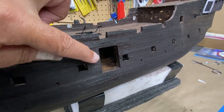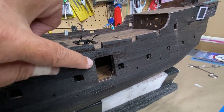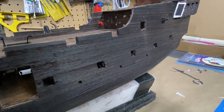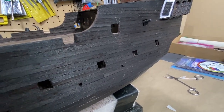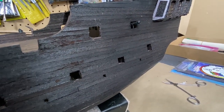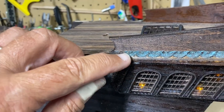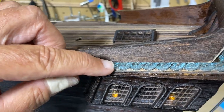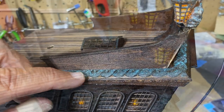There is an opening here that I'll work on later. You can see that my dark stain and one coat of tung oil has been applied; I'll give it another coat. Here you can see the alternate trim piece that I used, and the etching on it I covered in copper and have now aged with an ammonia solution.